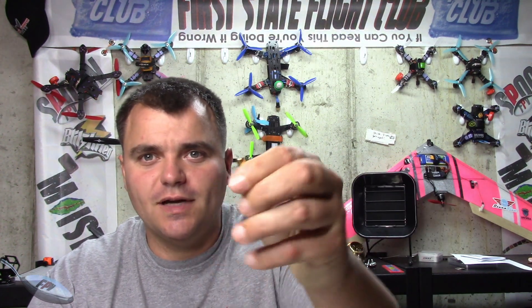They're really handy to have around. There's a few things you need to look at when you get them — I'll get into that a little bit later. So what is this little guy and what makes it so cool? They call it a dummy load because it basically simulates an antenna on your transmitter, whether it's a video transmitter or your radio amp transmitter, and what it does is attenuate the signal. Basically it eats up the signal that's coming out of your transmitter, so you're not transmitting.